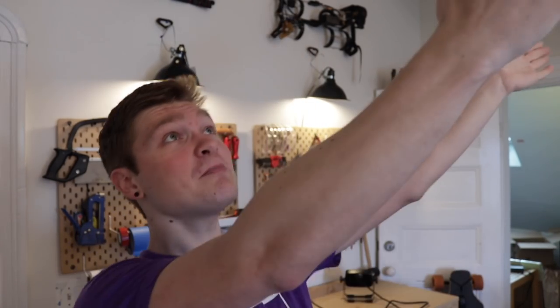I should also probably mention that the chip works with RFID, which is like if you go to the subway and you use that contactless payment card, it's the same kind of thing. The chip is totally unpowered right now, it's dead. But when you put an electromagnetic field near it, it will power it inductively through my skin, just like wireless charging phones. You just put it on that pad and it starts to charge. Same thing, it will power it through my skin just long enough for the chip to say, "This is my code." And then after it sends the code, it dies again. So it comes alive just long enough to say its name, and then it's dead. So my chip has a 10-digit name that when it gets powered up, that's what it yells out into the void, and that's what my whole system looks for. If it detects a chip that yells that name, it'll unlock the door because it knows it's me.